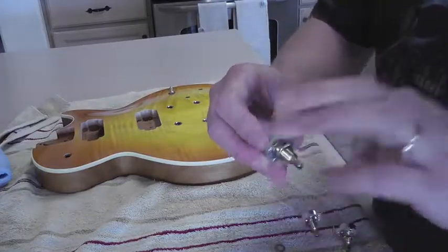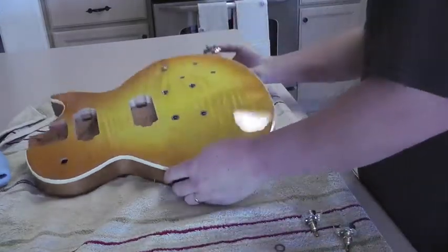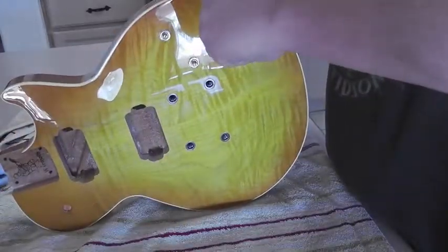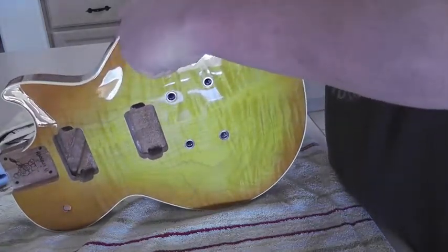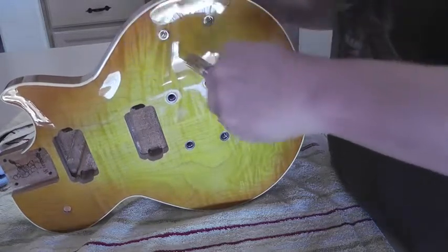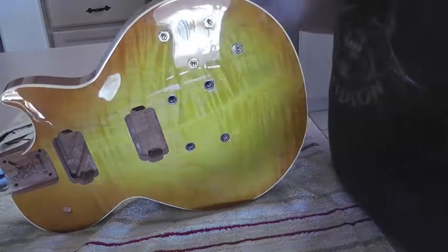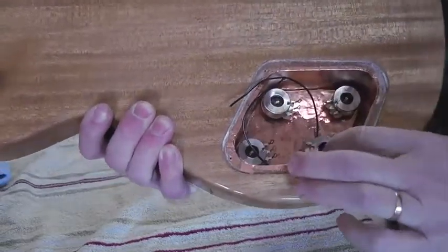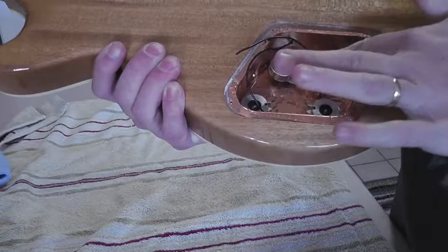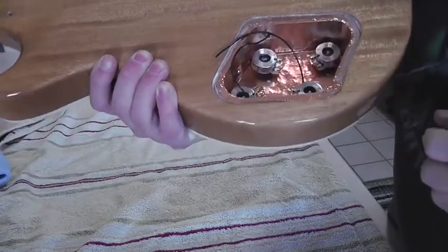For the rest of these I know that the front one was all the way down with my lock washer. I'll thread it through from the back and make sure all four are snugged down so they're not rotating, because I want a good solid surface to start my soldering. As you can see on the back, I've got the tabs pointing inward on each of them, which allows more room to solder at an angle. These two are my volume and these two are my tone. I'll go through the soldering here in a little bit.